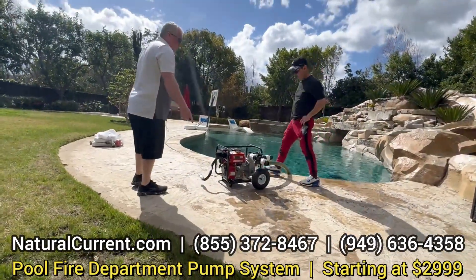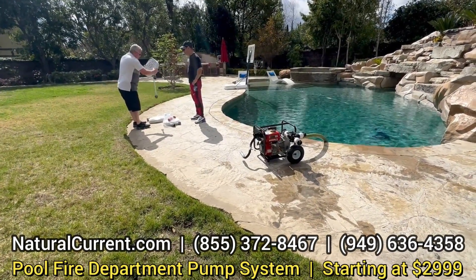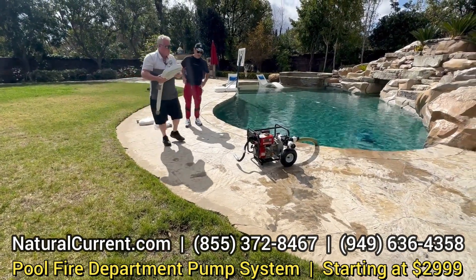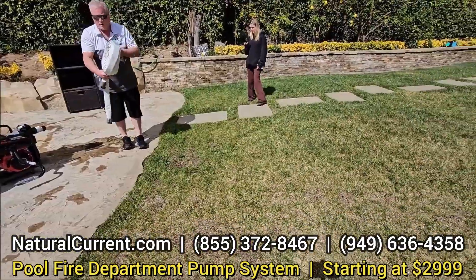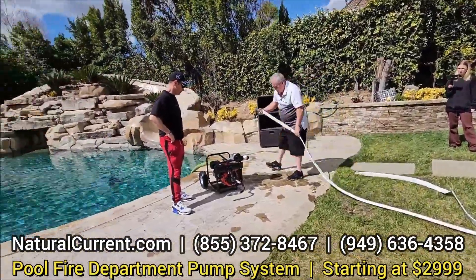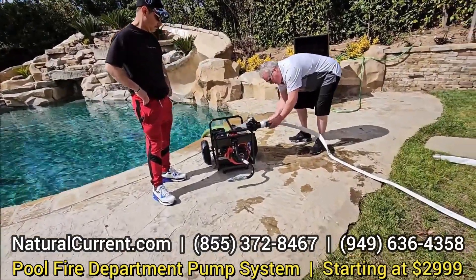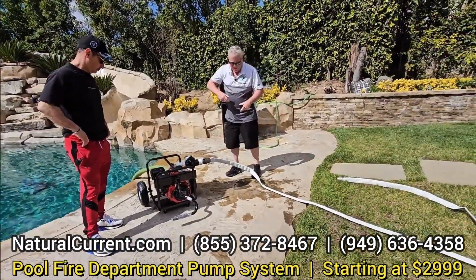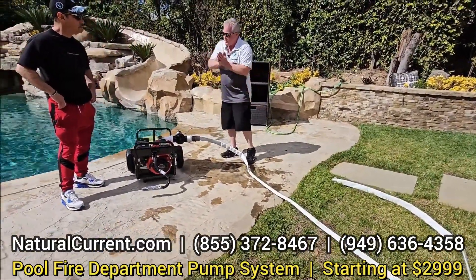Now we're going to go ahead and lay out the fire hose. On these hoses, when you roll them up — once we use them I'll show you how to roll them up. This is kind of how they go together. You just double it up and then you start on the end and just kind of roll it up. When you take that extra time doing so, you really take the benefit of rolling it out really easy. When you roll out the hose, that's all you really need to do. Then you can go ahead and connect your hose. Now, everything has gaskets, so everything just needs to be a good tight twist where you can see where it connected the gasket and you gave it a little something. You don't need to totally wrench it on — as long as it connects, you won't even have a leak.